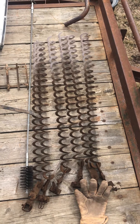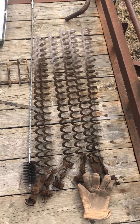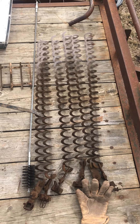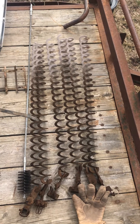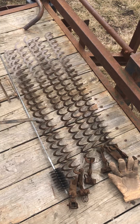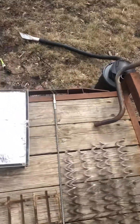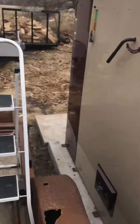These turbulators are different from a lot of manufacturers — they cost more to produce and use more metal, but they create a lot more turbulent air, keeping stack temps really low and creating really good efficiency. Those tight curls actually clean the heat exchangers. Flat twisted plates aren't going to clean those heat exchangers — when a boiler is new it'll be efficient, but over time you'll get buildup in round heat exchangers even if you're moving the handle back and forth, because it's not cleaning as well.